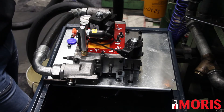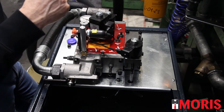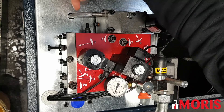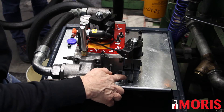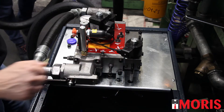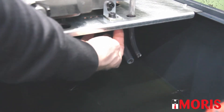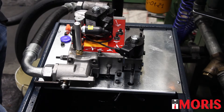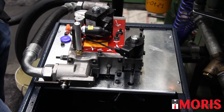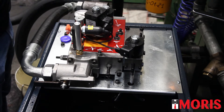During the up direction run, please check three discharge hoses: the hose of screw number 5, the discharge hose of the star delta electrovalve, and the discharge hose of the starting group below the distributor block. If during an up travel there is oil coming out from one of these three hoses, it means that the distributor block has a problem, and we have three repair steps to be followed: R1A, R2A, and R3A.